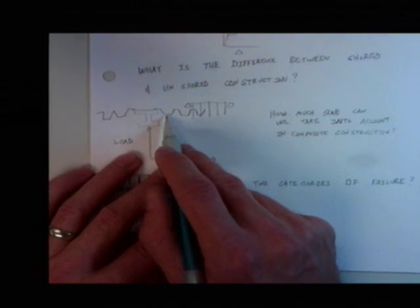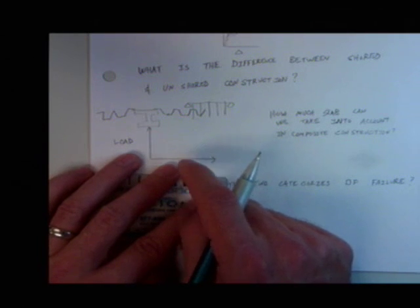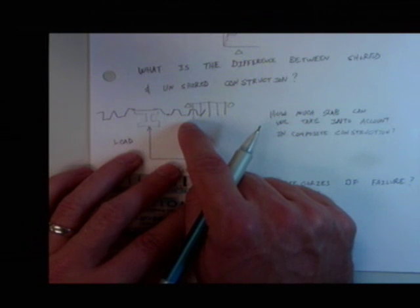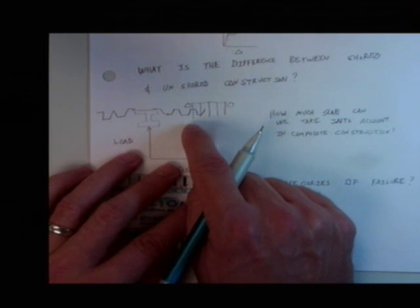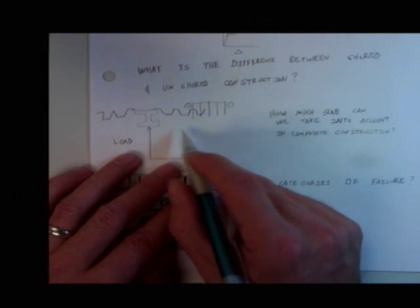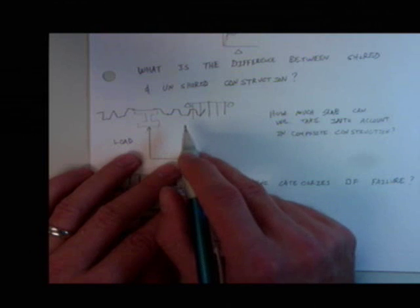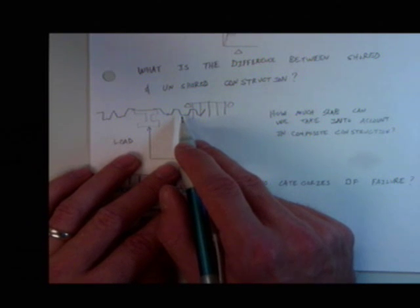They don't have to use metal forms. These are really, really thin, extremely thin, like a 1/16 of an inch thin. And these are extremely dangerous, okay? If you're ever on the job site, the only reason it has any strength and stiffness at all is because of its shape, okay? If you've seen one that's damaged, run, okay? Fast. Don't go near it. Because when you step, you will go right through. Okay. The other thing that's scary is with a hammer, okay, a decent-sized hammer, if it's dropped from not even very far, it will go right through it. So, who cares? Well, if you're standing even somewhat near it, not so good. Okay? So, pre-manufactured, take it from me, I've seen it happen myself. Okay? They're not safe. Okay? Gotta watch out for them.